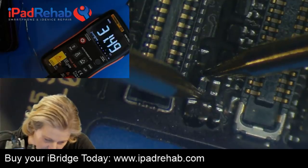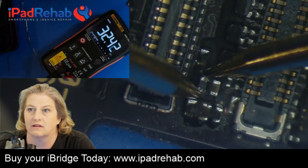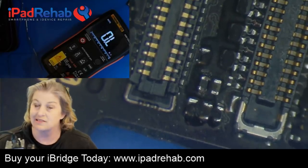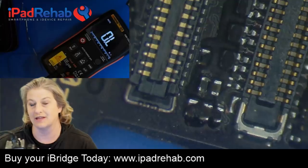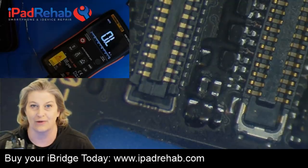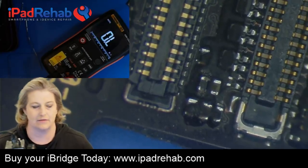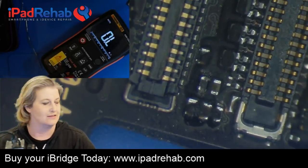It is 31 kiloohms. 31 kiloohms. So that is going to be high. So it's now turned itself into a 31 kiloohm resistor instead of a filter, which is a wire. So that explains why we don't have 1.8 volts on the connector side, but it's actually low down at 1.1 or whatever it was. So solution, let's go ahead and swap that filter out, and we'll see if that makes everything get better. But this is a pretty common fault. Everybody would already know to kind of look for here. This filter looks bad. This filter does go bad.